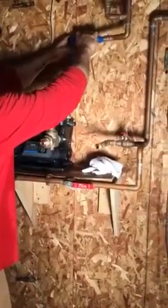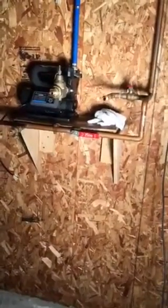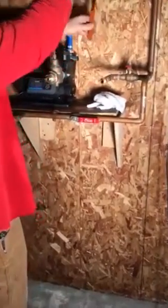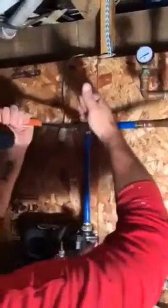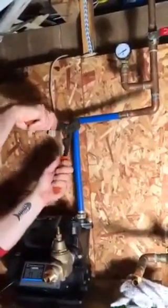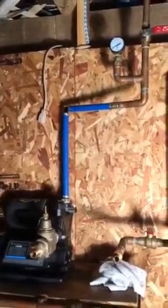This pump is going to be connected to three-quarter inch pipe. We're doing it in the PEX style, so it's very easy. PEX is a crimping style using PEX fittings — they crimp together. You just put the clamp on the fitting with a crimping tool, press in, and now you're connected. No soldering, no sweating of pipes.